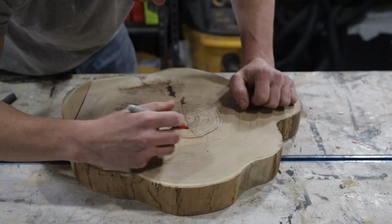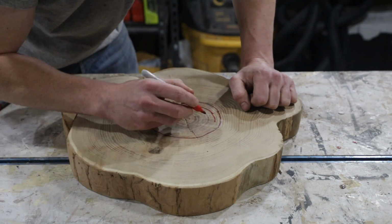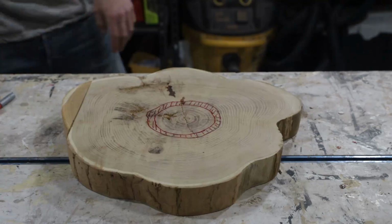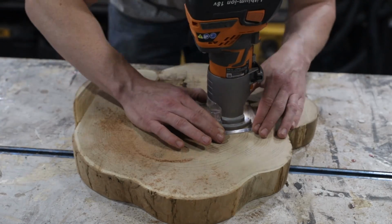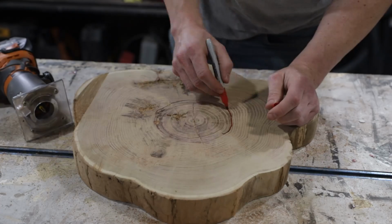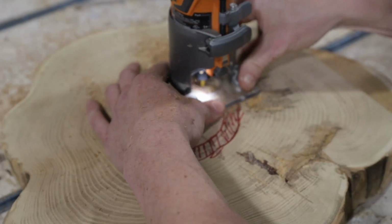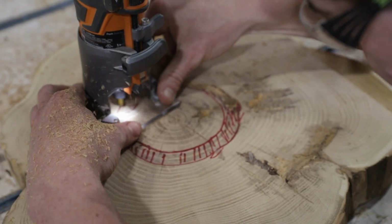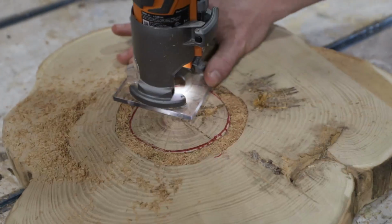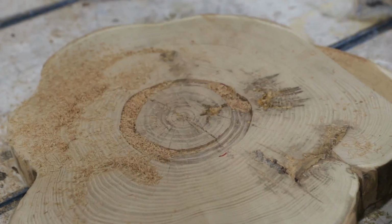One of my main goals with this project was experimenting with ideas I had for using epoxy resin to create organically shaped LED lights that followed the grain pattern of wood. And I wanted to see if I could carve out the channels for these LEDs by hand using a palm router. So I decided to experiment with this on the back I knew I'd be carving out later to make room for electronics. While I think you could do it, I'm not very skilled with a palm router, and so I decided ultimately to try a digital fabrication method for the actual channels on the front.